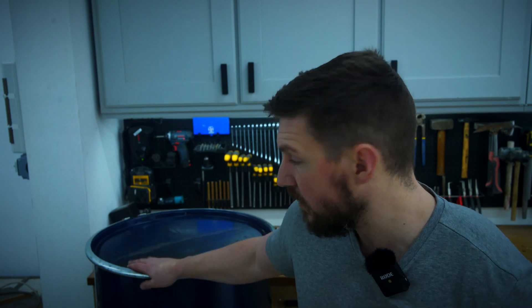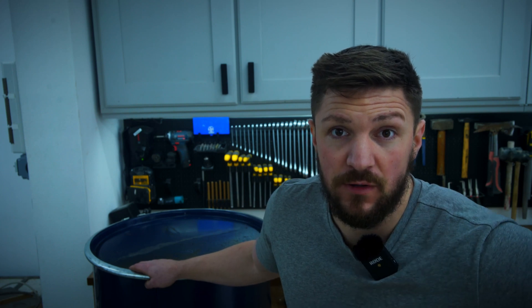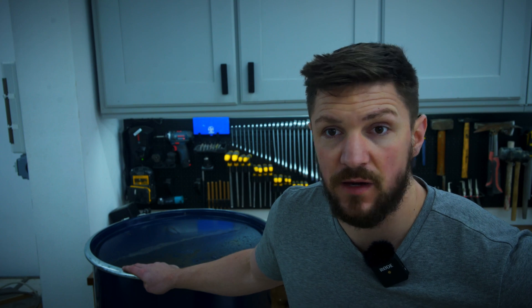Hello and welcome. Today we're gonna build a forced air diesel burner for my future furnace, since my old one disintegrated. But why not slap a propane burner on there and call it a day, you may ask yourself. Excellent question. I want to melt cast iron with this furnace and propane gets barely hot enough for melting cast iron.